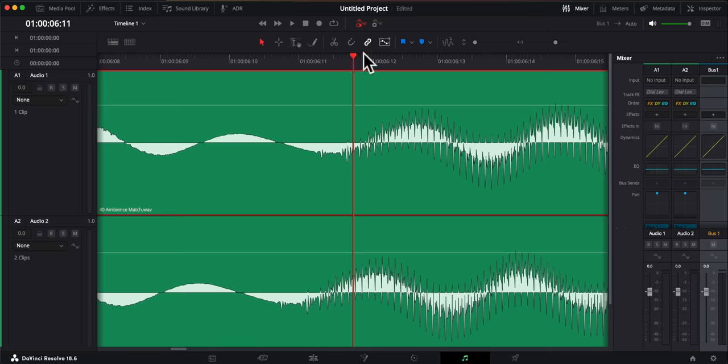Now, this is a digital wireless microphone system. And whenever you have a digital system, there is going to be some latency, some amount of time between when your audio is captured through the microphone and brought into the transmitter, digitized, and then transmitted to the receiver, taken from digital back to analog, and then fed to the camera. That takes some time. And in this case, it's 6.3 milliseconds that it takes.